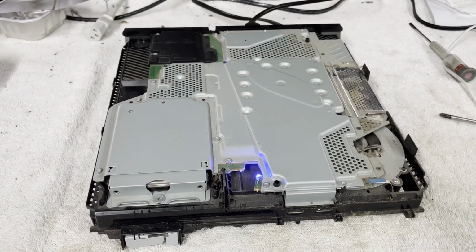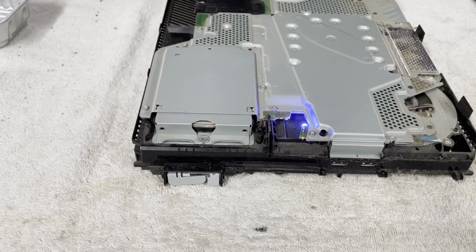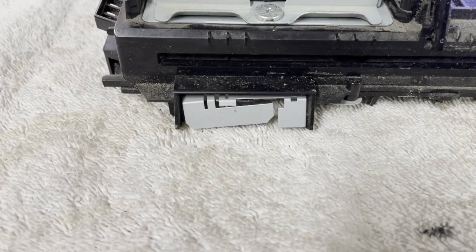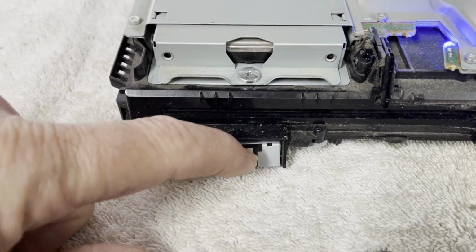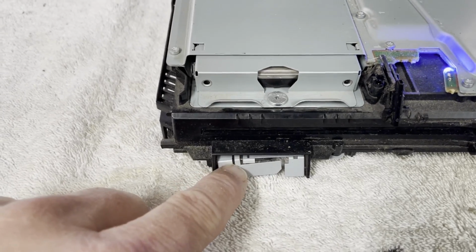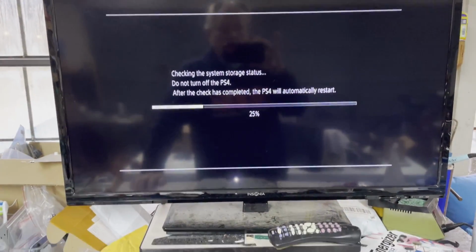We do. And there's a disk in the drive. Here it's spinning. And that antenna is kind of jacked up, isn't it? Have to see if they've broken the center conductor on it. That happens. If you bump this thing much, it breaks the center conductor where it solders onto this tab over here, and you don't have an antenna anymore. Hey, I think we locked. White light. Checking the hard drive.